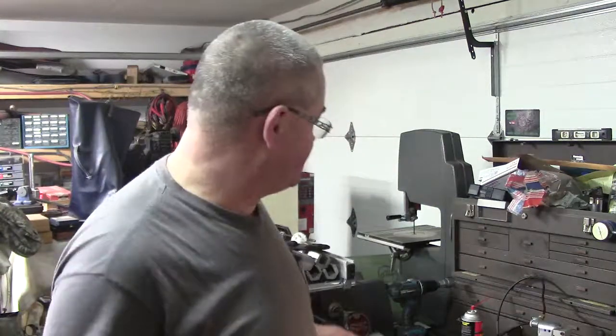I have learned on this particular scoop style, it likes a relatively aggressive feed rate. Like I said, down here on this, it read 2.5. So whatever that amounts to, you guys were able to see how quick it moved. Going too slow created the chatter and the messy look, like I showed you on the first piece of metal. Didn't want to go too deep. I did that on the first go around. I think I was at 15 thousandths, and that was off, and I was going too deep and too slow.